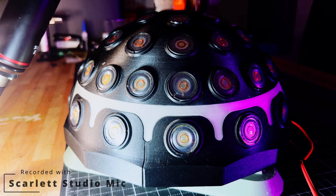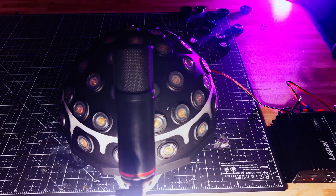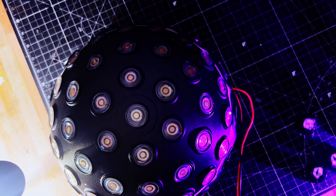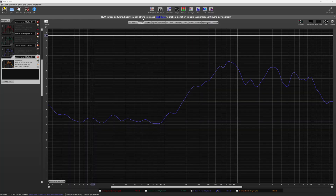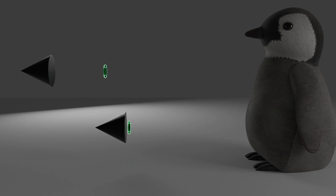You've seen the chaos. You've seen the theory. Now let's hear it. Here's the final REW curve from that exact setup — I'll flash it quick so we don't kill the vibe; feel free to pause if this graph is your vibe. What I love is how it fills the room. It's aiming for that omni-ish energy, but like any multi-speaker enclosure, timing is that gremlin you'll never quite tame. You can only be perfectly time-aligned for a single listening spot, so the closer drivers want a little bit of delay so that airspeed and sound waves can match. Perfect omni is kind of a moving target — and that's just not feasible, and that's fine.